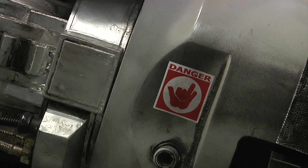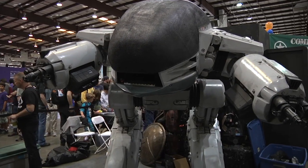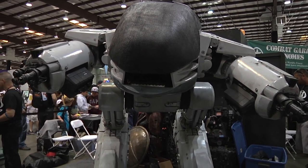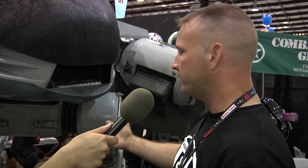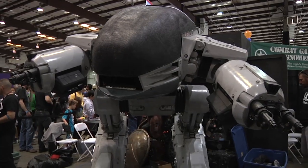It looks so detailed — this is made to be impressive in person, which the original wasn't. It was made to look good on film for just 10 seconds. So Sean, is this thing just static or is it supposed to move? The original plan was just static — all the way along this build I'd been promising to deliver one static robot. Along the way I caught my dad in a bored time where he was in a welding mood, so instead of the wooden frame I had planned, it ended up with a steel skeleton underneath. Based on that, I was able to install a couple of actuators to get some movement. There's a motor that will pivot it at the waist. There's another one that will elevate the pelvis so the whole thing can look up and down a little bit. The elbows have actuators so they can bend. Below the knee joint, we can actually extend the leg about 3 inches — it's very slow, a little wobbly, it scares me. But once we get the programming done for the controller, someone can hide in the back and use a PS2 controller to at least turn it and get the elbows to bend.